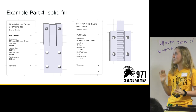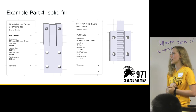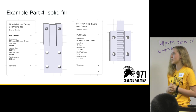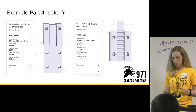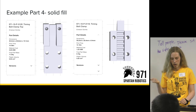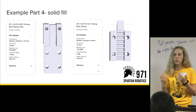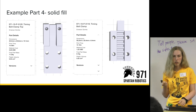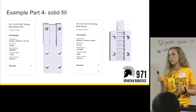This part takes solid fill. When it comes to smaller parts, we default towards heavier fills because we can — it doesn't take much extra time, and often the smaller parts are the most important ones that need to withstand force. This timing belt clamp was used for our stilts — it hooked into the timing belt and had to hold it really steady as the stilts pulled up the entire weight of the robot. So this is completely solid Onyx material.